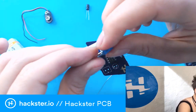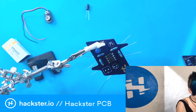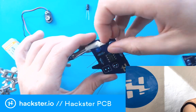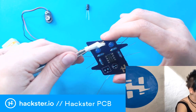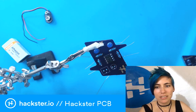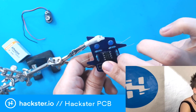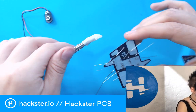Oh, I'm putting that in backwards. These LEDs are weird too. Normally an LED will have a flat side on the ground side — that's the short leg — but in this case that's backwards too. Lots of weirdness going on in this project. I'm going to solder them in and do this capacitor at the same time. That's got a little stripe indicating the negative side — but also we have a square socket over there. I'm going to have to follow up on this video and make sure that I've made the right choices. I think this is all correct though. We'll find out.